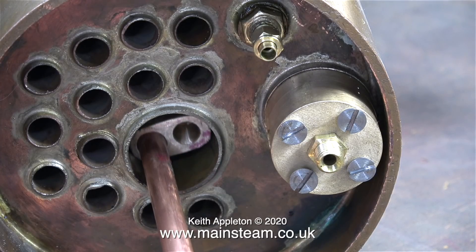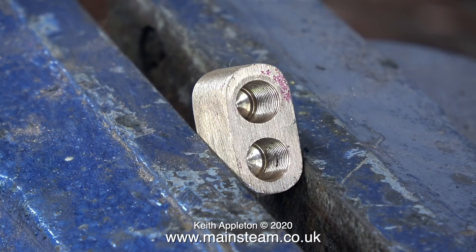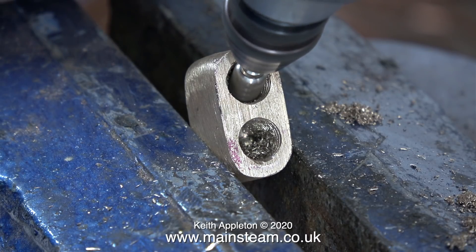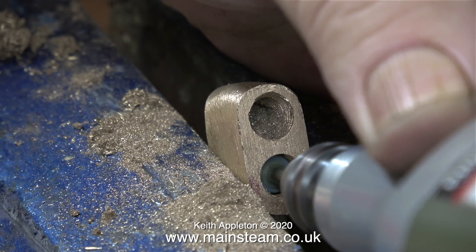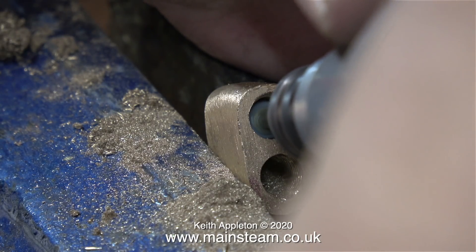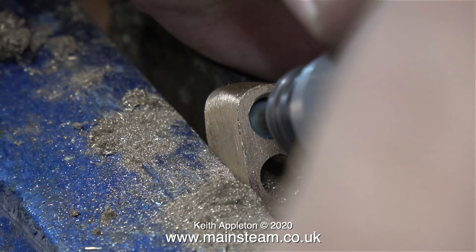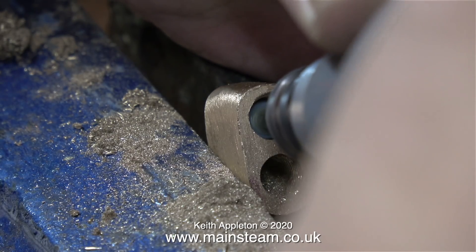I cleaned up the block and shaped it using my belt sander to fit down the superheater flue. With the block fitted in the vise, I need to make a hole between the two threaded pieces to allow for the passage of steam through the block. Using my Proxxon motor tool I first drilled a small hole between the two threaded holes, then used a coarse burr to enlarge it. It's more traditional to drill the initial holes at an angle to each other so they break through at the bottom. But I wanted my two superheater pipes to be parallel all the way down. Here I'm finishing off the job using a small grinder in the Proxxon motor tool.